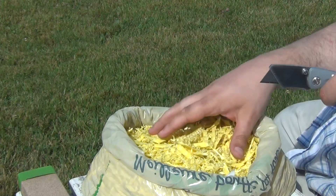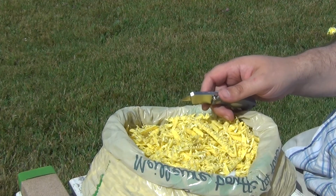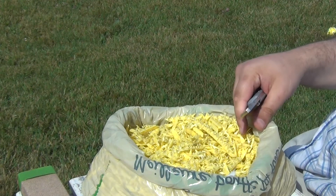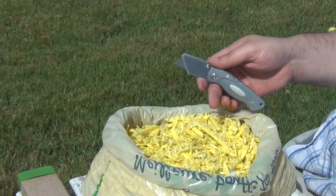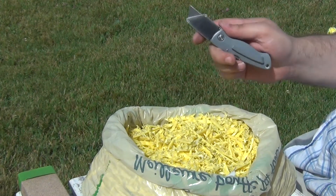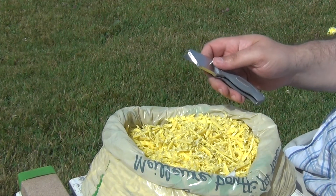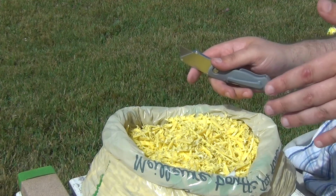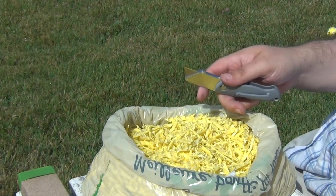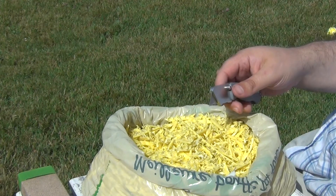This material is obviously just what's left over after using strip screws. If I get a bunch of it again in the future — and I need quite a lot, since I had to do 6,000 cuts to even do a basic comparison — I'll do another few experiments, pick up another pack of Stanley blades, and look at the as-boxed performance again. The first thing I'll do is use the cubic boron nitride rod finish and match the angle exactly, giving it the exact same 12 to 13 degrees per side, to take the angle change out of the equation.